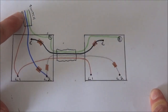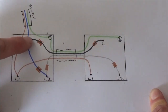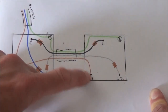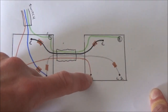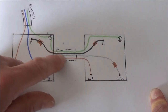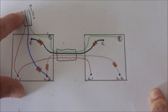The way this system works is that you have a permanent live feed to the L1 at all times, and you also have that permanent feed to the L1 on the other light switch at all times. Now with a two-way switch where you have the L1 and the L2, switching it on and off you're either taking the current from the common to the L1 or from the common to the L2. So for example if the switch was going from the common to the L2, the live feed on this side would be terminated. However if the switch was going from the common to the L1 on this side, you'd have a live feed going up to the common, across to that common, and if this switch was in the position to take it to the L2, the electrical current could carry back down to L2 and return back up to the light to turn it on.